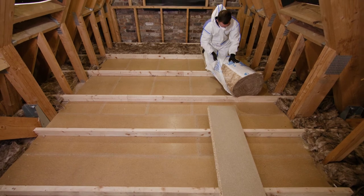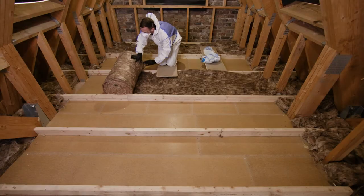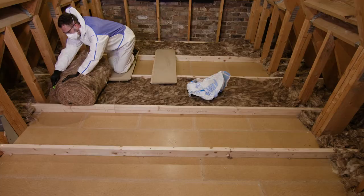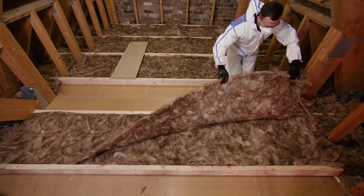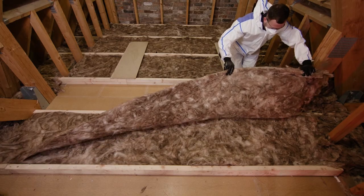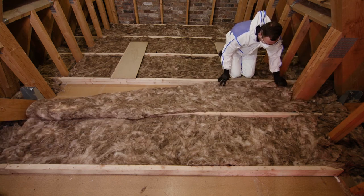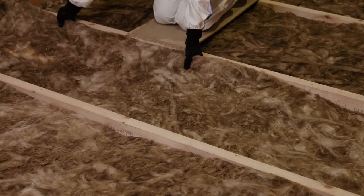Remove the packaging and roll out fully. If you are installing to 100mm, ensure it fits snugly between the joists. If the roll is too long, it can be cut to size using a retractable knife. If installing to 50mm depth, take the furthest corner of the 50mm top layer and, using the rolling technique demonstrated in the film, roll over into the adjacent joists.